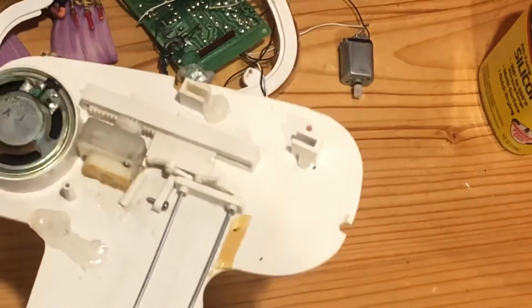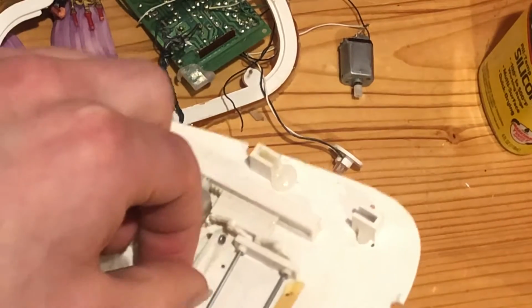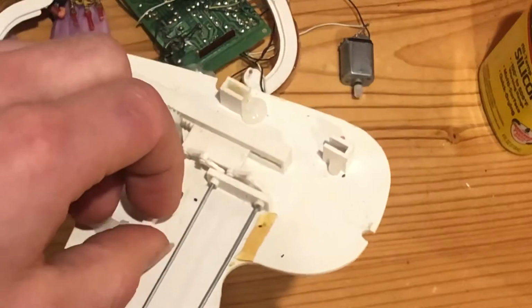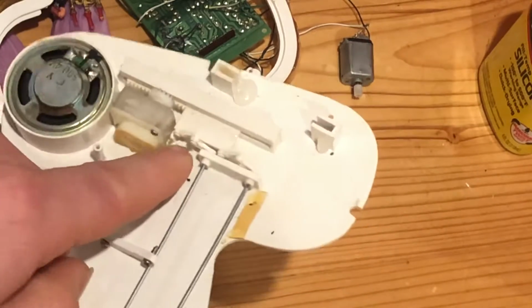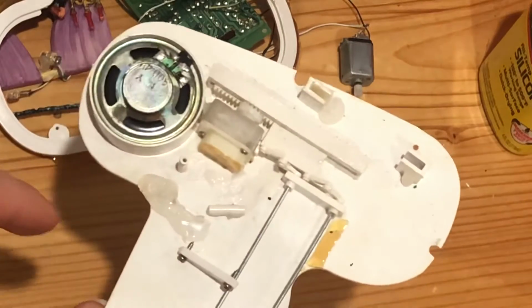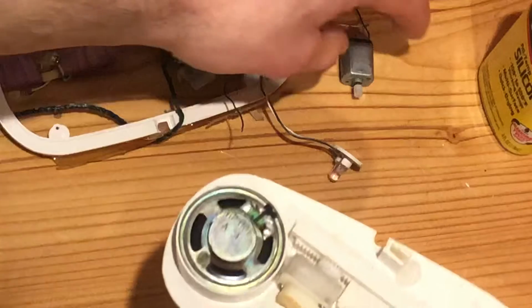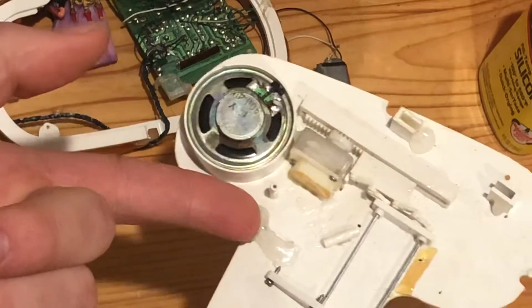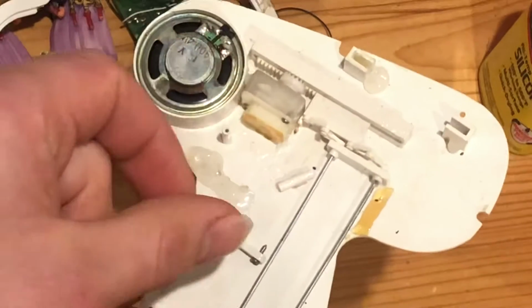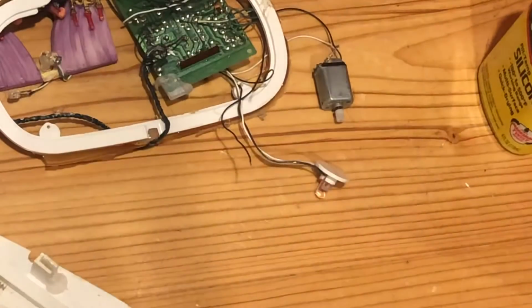Also, you'll want to make sure that the motor is removed. For that, there's these 2 little Phillips head screws on the top securing this bracket. One of the plastic pieces came off, but the motor's straddled in between the 2 pegs. And then you can just use a little screwdriver to lift up and pull the motor out of the gearbox. So that's how you take that off.